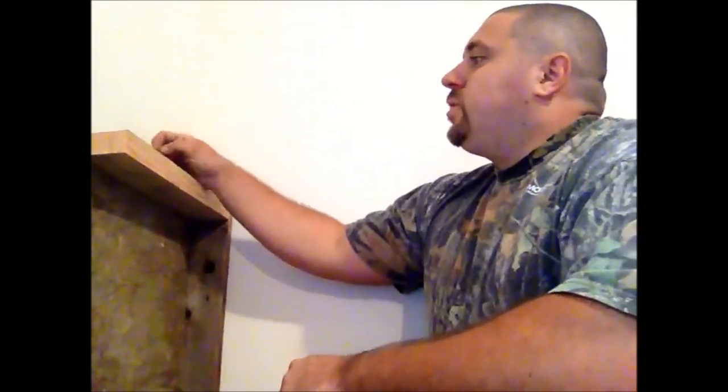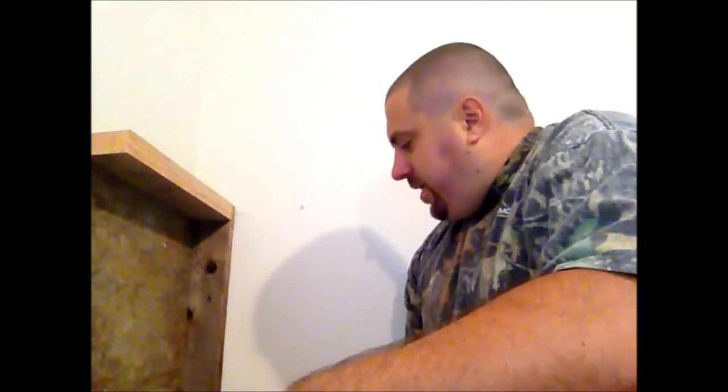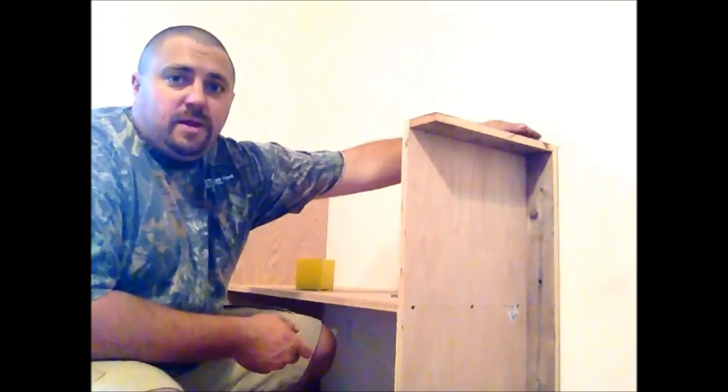In the last episode I went around and marked out all the studs on the wall so I knew where they were, making it a lot easier to fasten all these boxes to the wall. I see where I marked my stud — it's right here. I take my tape measure and measure from the wall in to get the stud location. I have a stud marked at ten and one quarter inches, so I know at ten and one quarter inches from the wall I have a stud all the way down, so I don't have to mark this out each and every time. Once I get a top and front plate on, these screws are going to be hidden, and the stud falls right directly behind this piece of wood, so I'll fasten this right to the stud.